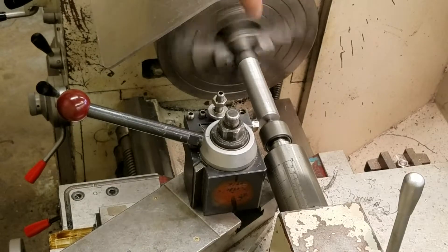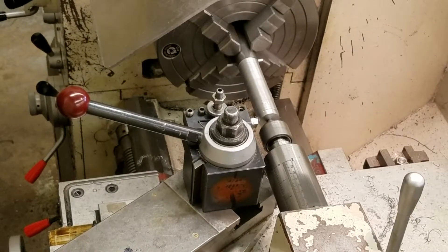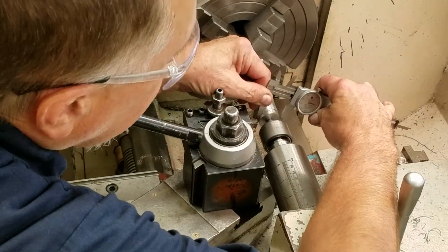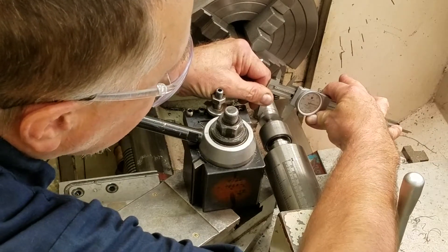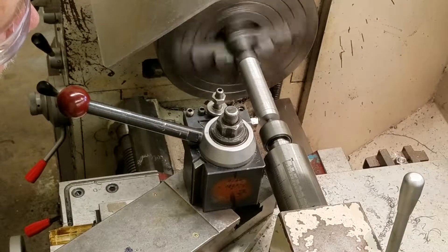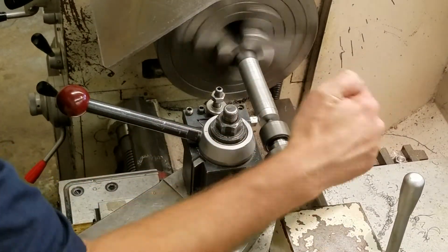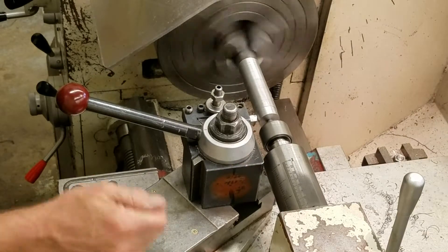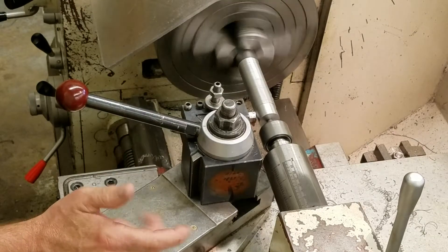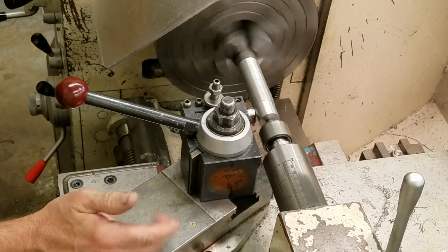One thing I can do is stop the machine right here — probably not a good thing to do with carbide, but we're okay with high speed bits — and I can measure it right here. I'm at 1.125, and that's the diameter I want it to be. I'll start it back up because this end is going to be turned down to a half inch anyway. So I'm going to come back and clean it up. The diameter I want to get to is 1.125. I started out at 1.250, so it was an eighth of an inch. I took 60 to 61 thousandths earlier and I'm taking 63 now.